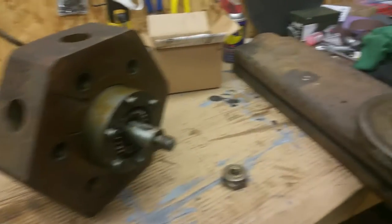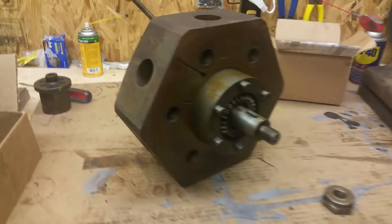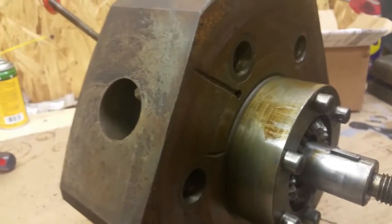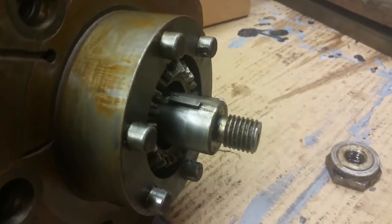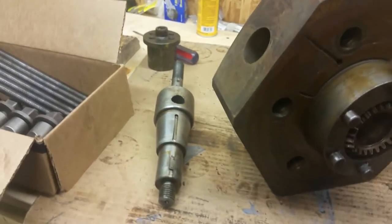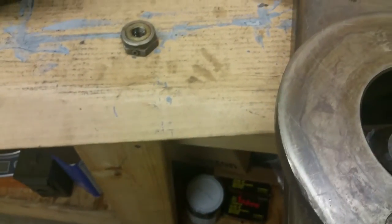I finally got the turret head off. It's heavy by itself — probably 50 to 60 pounds — and I'm guessing this section here is 100 to 120 pounds. The bottom face looks like it was lacking lube for a while. I tried knocking this shaft up from the bottom when it was all together and it wouldn't go, but once I got the head off the shaft falls right out. Inside the turret head it was on a taper, so I think it was stuck on the taper. The bore on this part of the turret head into the bore here was really tight.